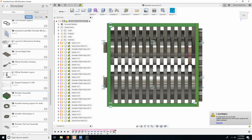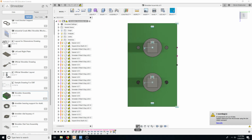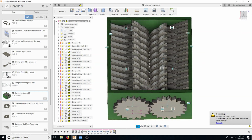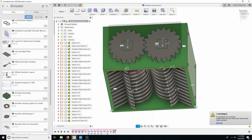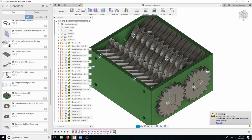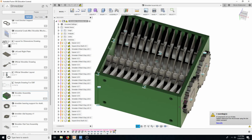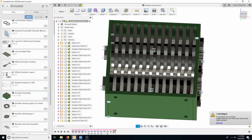I decided to cut out of a solid piece of 3.5 inch round bar, basically. So you can see that the blades go right up to the top of this thing here. So basically, from blade tip to blade tip is 3.5 inches. So basically, have a fourth axis come in here, hold this, and a 3-axis come in here with a small cutter and cut this all out.